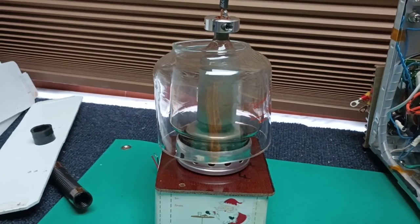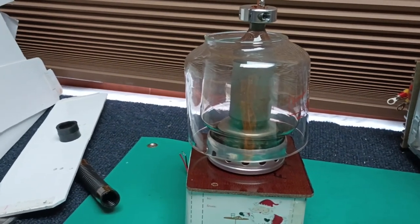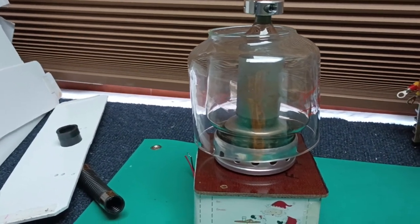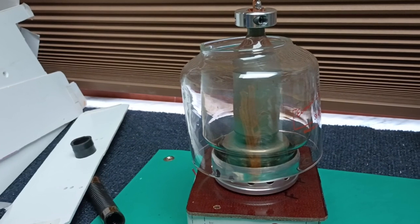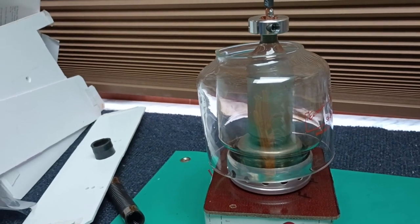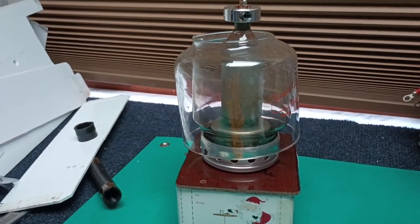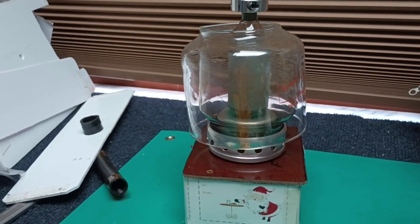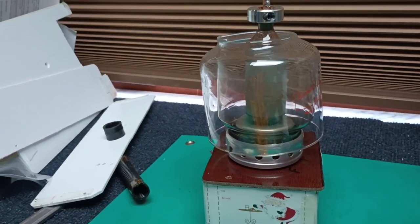And realize that the plate in there is only giving off a small amount of energy that's being intercepted by that glass envelope and chimney. The glass items are heated by infrared emission from the plate. But the glass is mostly transparent and very thin, so it's not a great deal of heat. So understand that the airflow that's intended to operate the tube should really cool that way down if it's just a filament, because it's not causing the glass to intercept much heat.